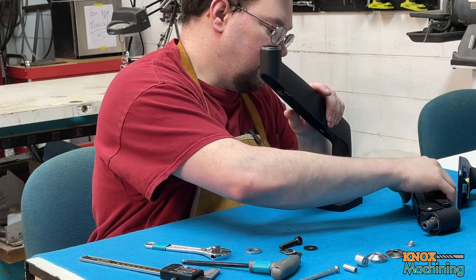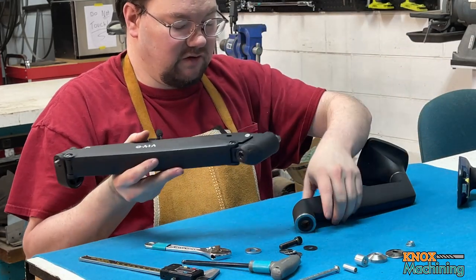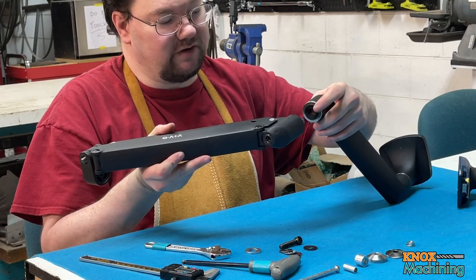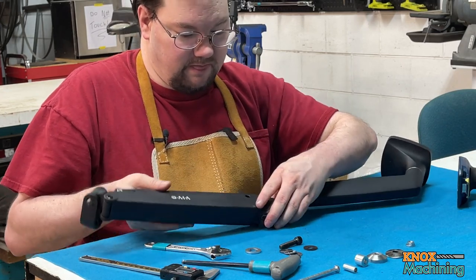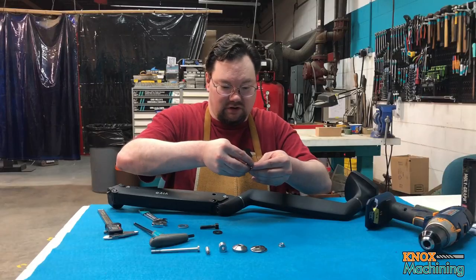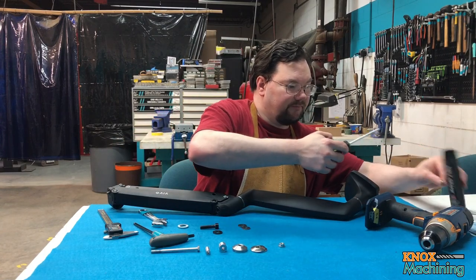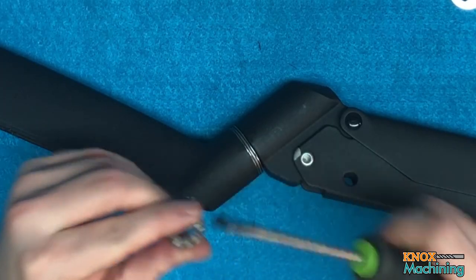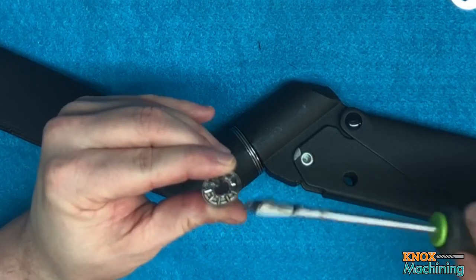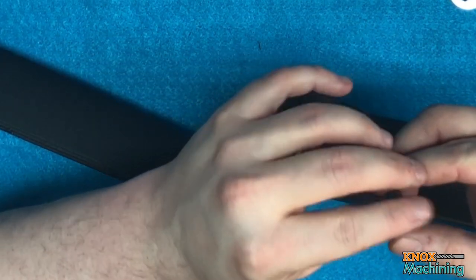And the upper arm assembly has a recess in it that's gonna allow clearance for that bushing, so there's not gonna be any interference with those two. So we'll just put them together. And then I'm gonna take and prep the smaller bearing with some more Molly. And it's so tiny, it doesn't take a lot. There we go, that's enough. Top thrust and bottom thrust washer.